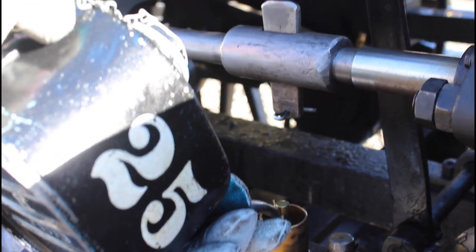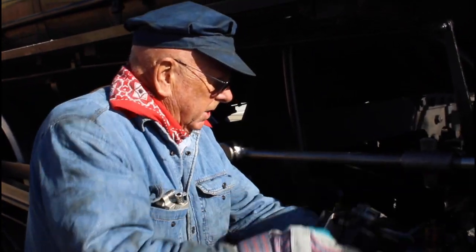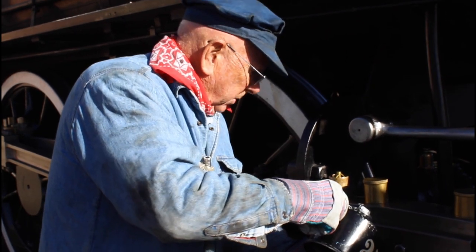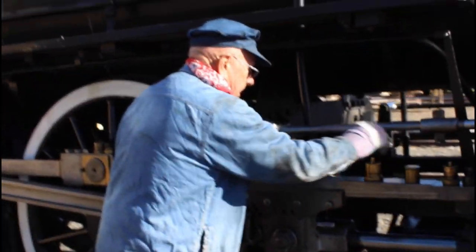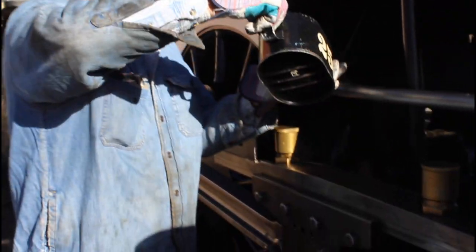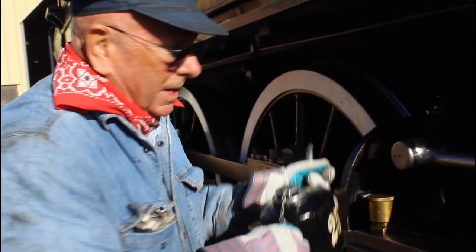This particular locomotive uses two types of oil on the running gear. On the parts of the running gear that are apt to get warm, we use a non-carbonizing oil called a valve oil. It costs a little bit more than the oil we use on the parts that stay cool, because if it carbons up, it loses the efficiency of the oil. As a general rule on a locomotive like this, all of the parts that are outside the frame use the valve oil, and all of the parts that are inside the frame use the engine oil.